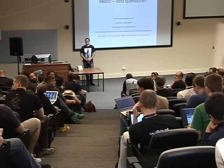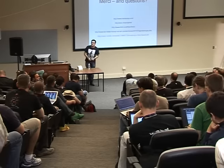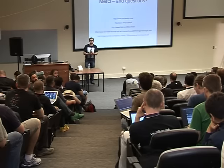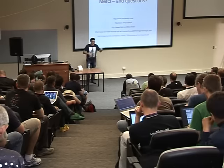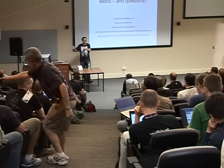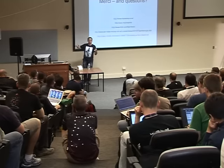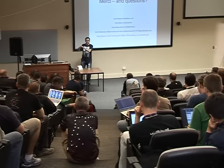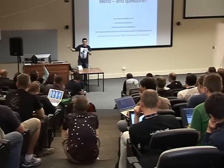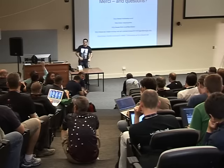Hi, mate. I'm just wondering what kind of JTAG tool chains you use. OpenOCD is cool. They support a whole bunch of processors. I use something called Cable Server. So this was for the Xilinx system. I was trying to program a Xilinx device. Xilinx have got their own Windows and Linux proprietary stuff, which bit-bangs the stuff through the parallel port. One of the other things it can do is talk to one of Xilinx's proprietary boxes or another PC running their own cable server thing. Someone's reverse-engineered the protocol and written a Linux-based open-source application, which you can run on any old Linux box with a parallel port and then point your proprietary Xilinx software at to program. It was that part that I'd have running on the ADSL box.